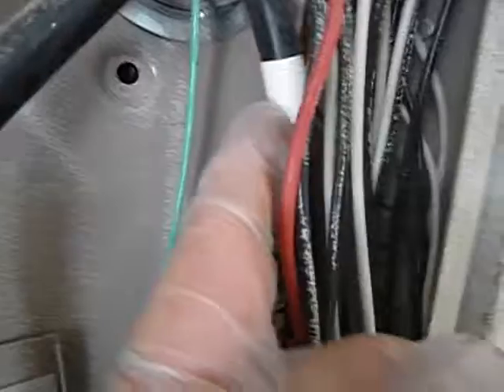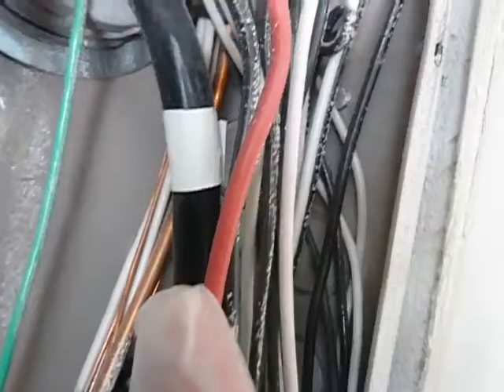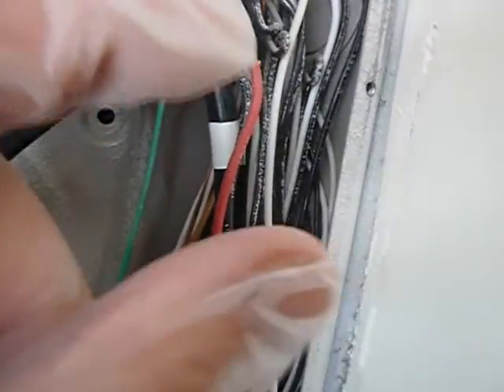Here's L1, L2 — this is your bonding. Your main neutral — see that white tape wrapped around there to identify it as the main bond? If you don't know that's the main bond without the tape, you don't belong in this panel. But it's supposed to be wrapped three times — not once, three times, and staggered, not three in a row.